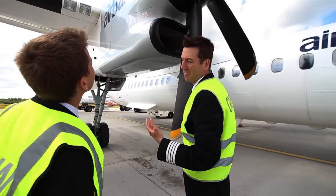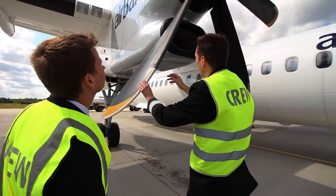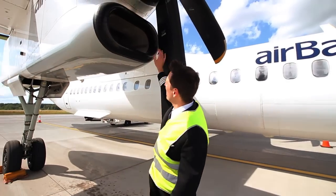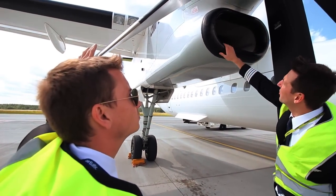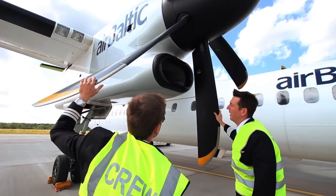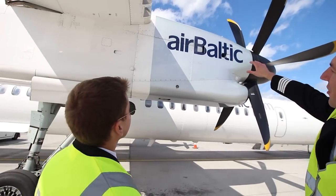Don't be tempted to spin the propeller the other way, or you could damage your oil seals in the gearbox. Same for the propeller blades — don't be tempted to move them fore and aft or twist them, as this too may damage your oil seals in the hub. Behind the props we have the engine intake and de-ice boots — just check they are in good condition. Same for the engine outboard panels and cowls — check they are secure and no blockages of the nacelle drains or outlet ports.